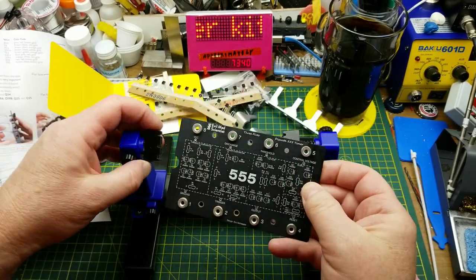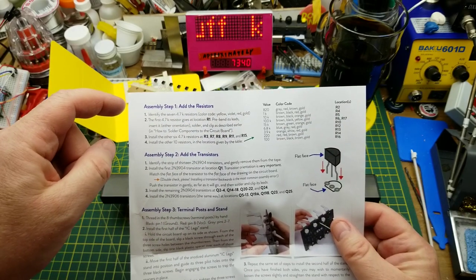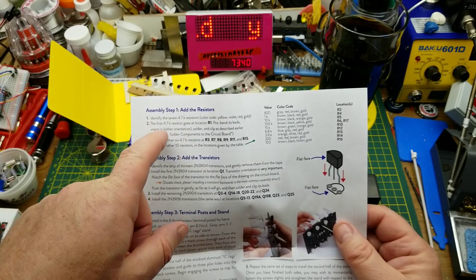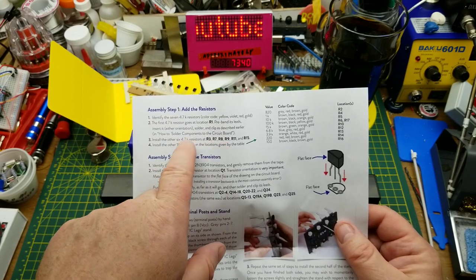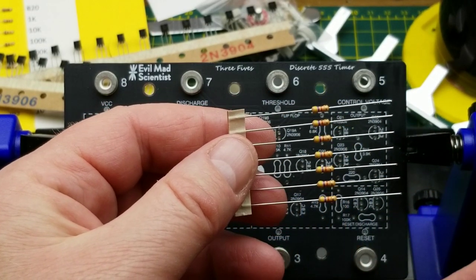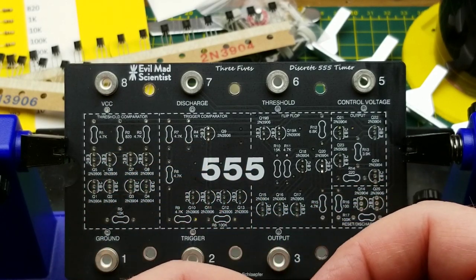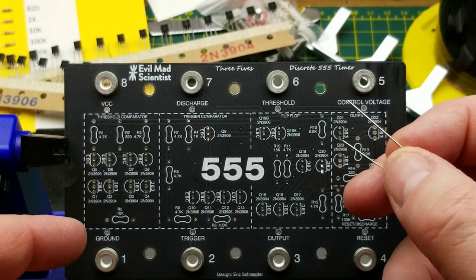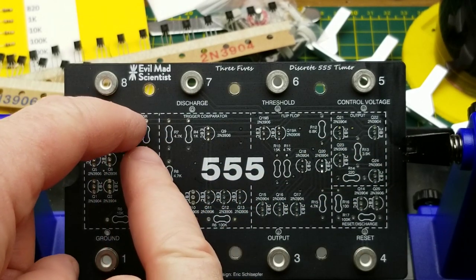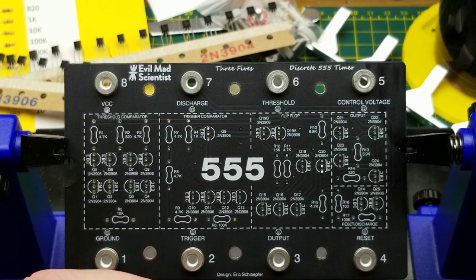The board is so thick it doesn't fit in those notches, but it does fit in the ones sitting that way. According to the instructions, they recommend adding all the resistors first, starting with the seven 4.7K resistors, then all the rest based on the table. I'm just going to trim one end of the resistors off the carrier tape to make them a bit easier to deal with, pluck them out one at a time, give them a gentle bend, and find their locations on the board. R1 is where we might as well start - they've got it all labeled from left to right, so R1, R2, and R3 are up there, and R16 and R17 are down in the bottom right corner. Very logical, very nicely laid out.